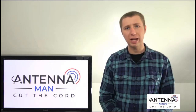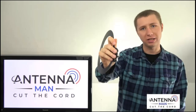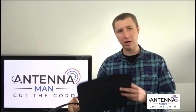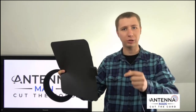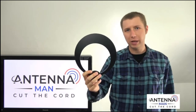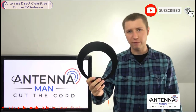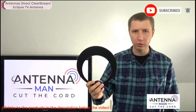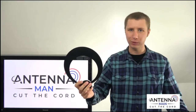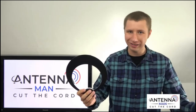However, I'm hoping to get slightly better results with this antenna, especially because it has a dedicated coaxial cable output, so you can get a much better connection compared to the paper thin coaxial cable on this junk antenna. Looking at the design, it looks like a pretty simple UHF loop without any VHF elements, so I'm not sure how well it's going to do with VHF TV stations, but then again, anything is possible because there are 150 mile range high definition digital antennas out there.